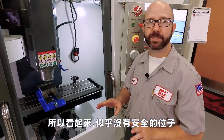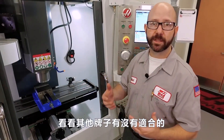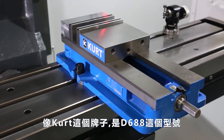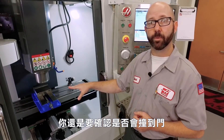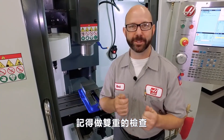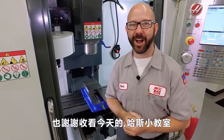It looks like there's no safe position to mount this particular style of vise on this size machine. If you need a vise for your TM1P, check out the different brands, look at the specs, and make sure you find one that fits — for a Kurt, that's likely going to be a D688 vise. But even with that vise, you still have to make sure it's mounted in a way where it won't hit the doors or your way covers. Measure twice, cut once — or in our case, measure twice, or go on HaasParts.com and order those way covers. That's it, and thanks for watching this Haas Tip of the Day.